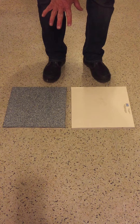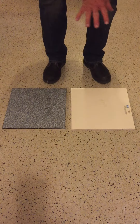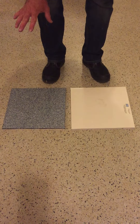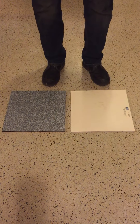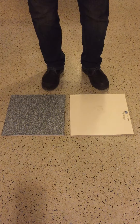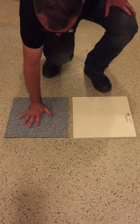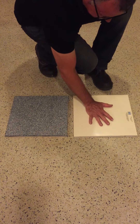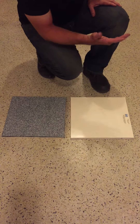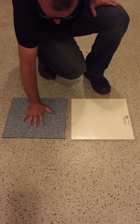I've just conditioned these two pieces of membrane. On this side, the light color is a fiber type membrane, and on the right is a bitumen-based membrane — this is the duo bitumen-based torch-on. What I was going to do here was just show the foot traffic resistance of these membranes when they're heated. I've heated these to 70 degrees centigrade, which is warm to the touch and about the heat you would expect the membrane to get to in the afternoon sun on a summer's day in Christchurch, Auckland, or maybe Wellington.